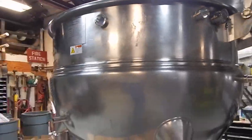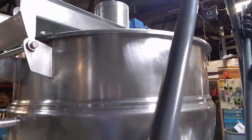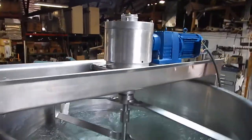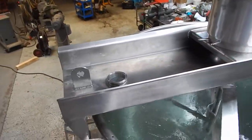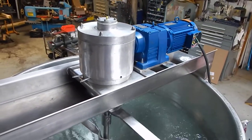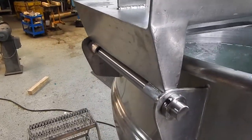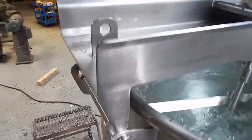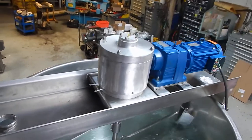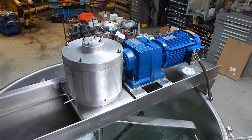Let me come around and show you the other side of the vessel. It is a tilt-out bridge, however it doesn't have its own movement for that. There is a lifting lug right here. The right side below the drive is the hinge end, and with all Hamilton's the bridge sits on this bar which is locked in place with a set of collars. We've added a new Euro drive that's 3 horsepower, which the factory calls for on this size vessel.